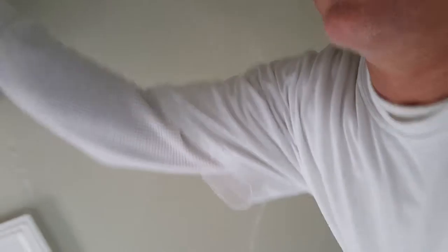Look at all this paint — I just scraped it right off this wall and it just keeps on coming. You cannot coat over this. Once you put paint on loose material, that stuff starts breaking apart and rolling around on your roller. Then it starts chipping off the wet surface, you start scraping it, wet chips fall, you step all over it. You need to do your prep work.